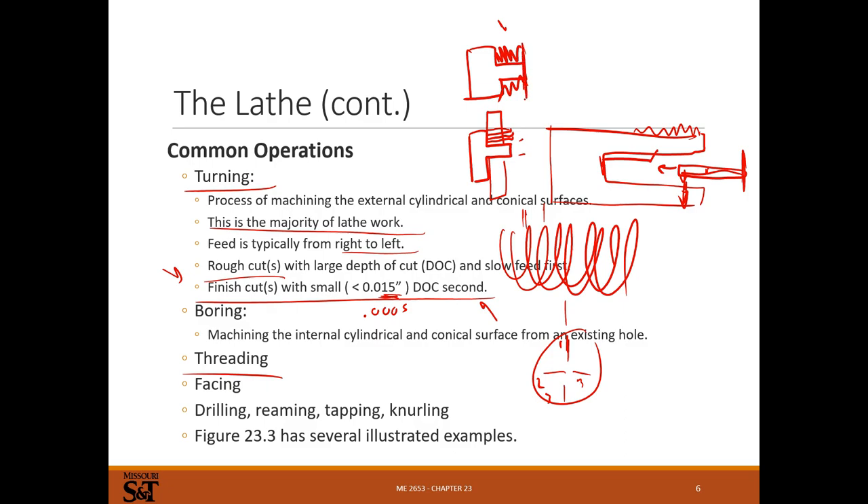Facing - that's when you cut the facing surface, and it's usually about the easiest thing to do. Good surface finish, as long as your tool height is set up correctly. If your tool is too low, you usually get a little nub left in the center. If it's too high, it doesn't cut very well and might do bad things when it gets to center - it might kick the part up or down. I've seen people bend their parts just from the stress of trying to smush that nub off. So tool height is really important when facing and turning, but especially facing.